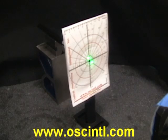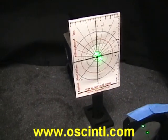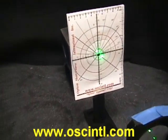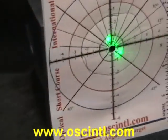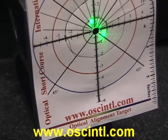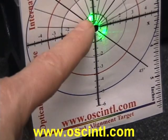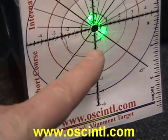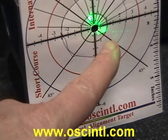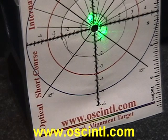Turn the lights back on — we have an aligned lens. If I zoom in, you can notice the retroreflection targets: one is just above the hole, another one is below the hole. But they're centered, and there are actually two pairs — one from the front surface and one from the back surface — aligned on top of each other.